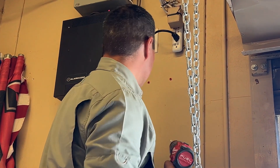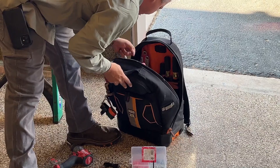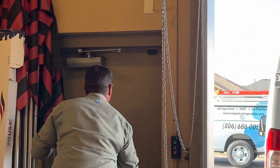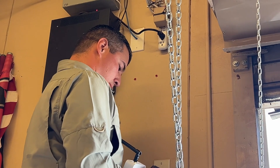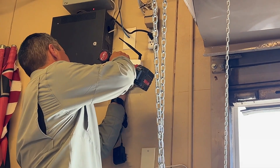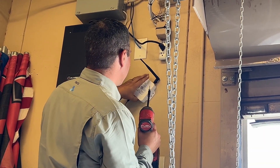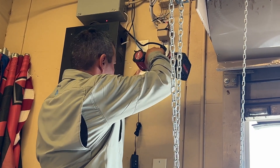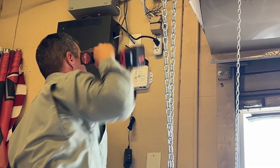Anchors are in place. Grab your impact driver with the Phillips bit and we're good to install this gateway. I always feed my screw through the bracket first — that way it makes it a little bit easier to hold and you just screw it in a little bit, just enough so it won't fall on you. Then you can hold it up and get it ready for your second screw. Just make sure you're not screwing down all the way where you break an ear off. And that's it.